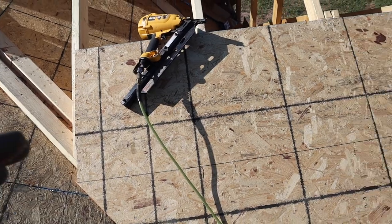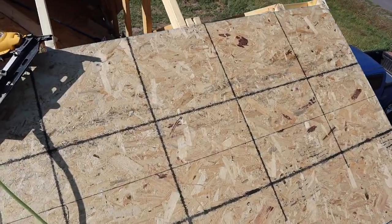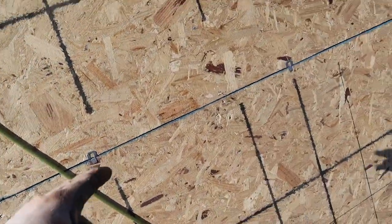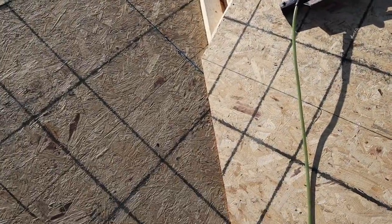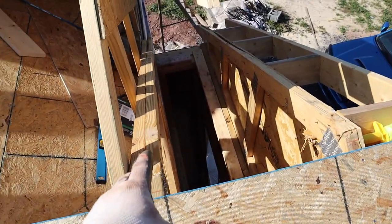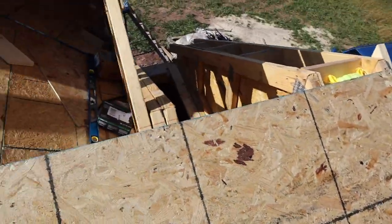This sheet's on. No matter how much I measured and tried to make sure it was right — and since this is a YouTube channel I want to keep it real — it didn't line up perfect. I got it looking really good though. I didn't want to waste the sheet, so what I had to do: it was standing up about an inch over there and nothing over here, so I just had to chalk a line and rip it down so it shifted into place. It made the angle correct. Sometimes you've got to do stuff like this. I also had to plumb this section and take this brace off and nail it secure. That's that sheet done — now the next thing is we've got to fill in this little crack.